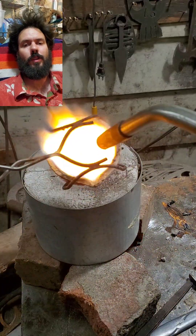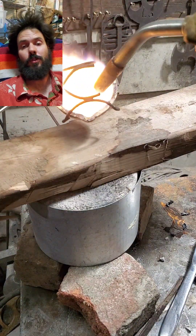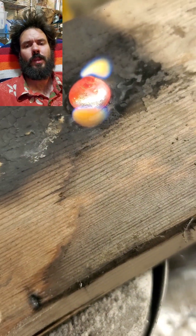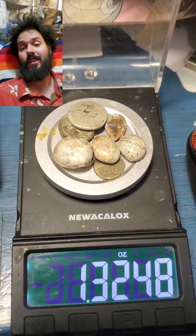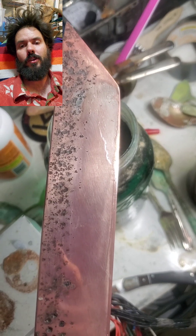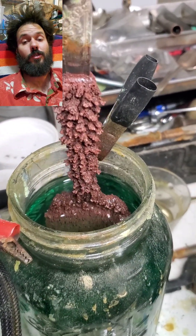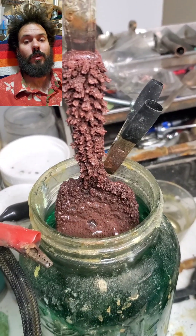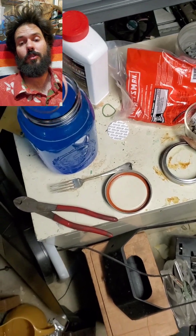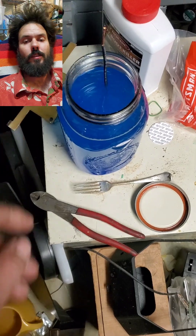I was piling up all the stripped silver spoons — the brass cores — and had to figure out what to do with them. I discovered that if I dipped steel into the solution, copper would bond to the steel, which was cool. Then in one of my stripping experiments I saw copper dendrites migrate from one spoon to the other spoon. I was sucking the copper out of the brass, so I did a little more research on it.